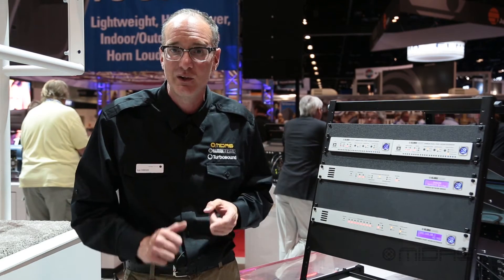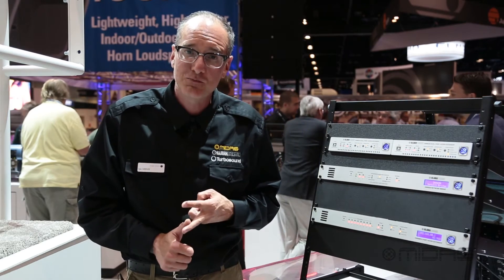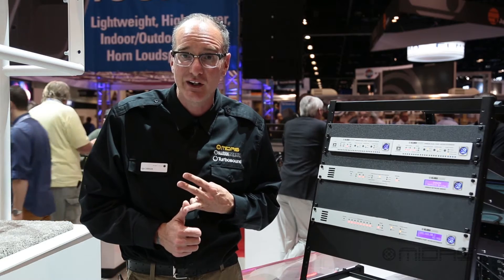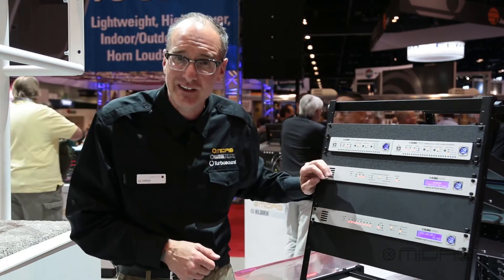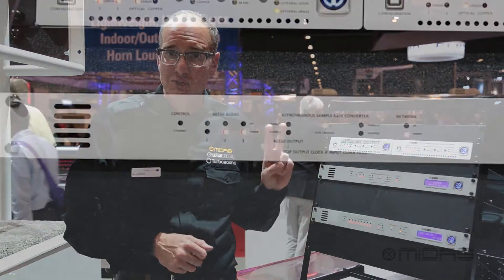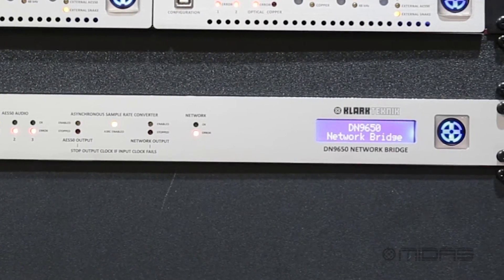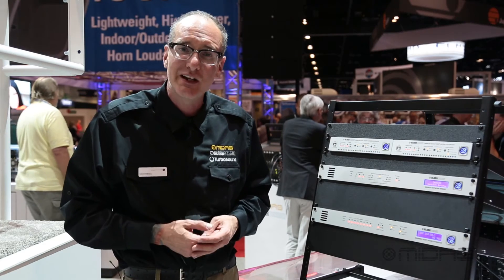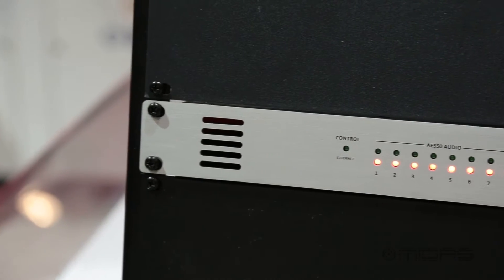This will allow you to get to your DAW for recording or virtual sound checks, Waves plugins, possibly in-ear monitoring, or a broadcast console — it's a very versatile unit. We also make a DN9652 that switches protocols via two CM1 card slots in the back, so you could go MADI to Dante or Dante to Ethersound — any combination, giving you conversion between those manufacturers and connection types.